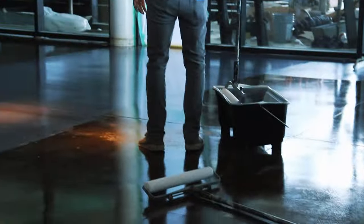Once we finished the inside, it was time to do the outside. We treated it like two different projects because it was different materials out there. We used a solvent-based sealer outside — this stuff dries almost instantly, you barely have enough time to do the pickup method. It was just as simple as rolling on two coats. The whole wall was glass and it was late in the day with the sun going down low and hitting the glass — I remember feeling like I was being cooked, worried to death about how it would turn out. But somehow it worked; it didn't bubble or anything.